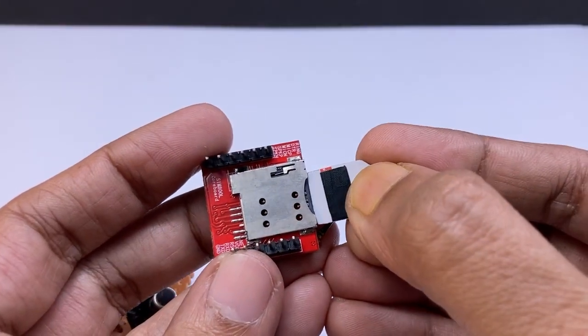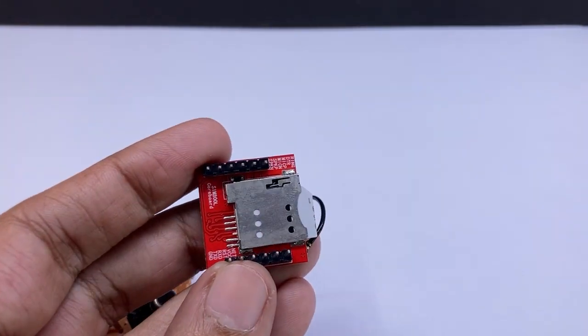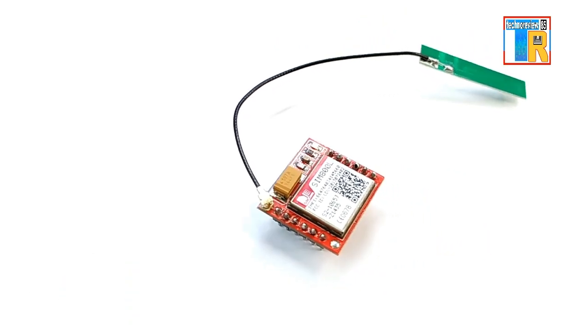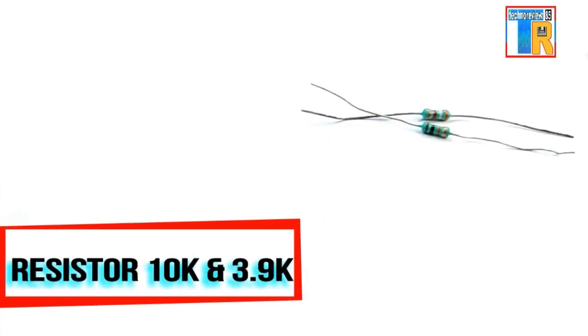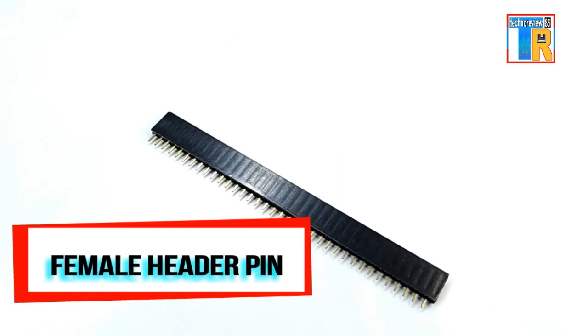This is working with a 2G SIM card. I used an Arduino Nano and a SIM800 module. Capacitor 470 MFD. Resistors 10K and 3.9K as a 3.3V logic level converter. DPDT switch. Power bank module. A condenser microphone. Some header pins.